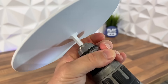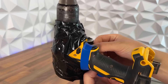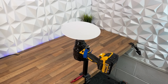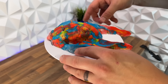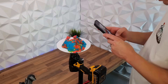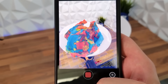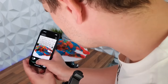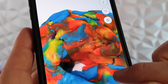So after a few minutes and less than a dollar of filament, I attached it to my drill and with the help of some gaffer tape, I should be able to rotate the mouse 360 degrees and get a full scan. After deciding that manually controlling the drill was a better idea, I started getting my scan. But even though I'd set up everything right, I couldn't get the LiDAR scanner to actually work — it seems LiDAR is more designed for quickly scanning larger areas and spaces rather than stationary objects. So I switched over to photo mode where I had to take a sequence of photos all around the object to get as much detail as possible. And the results were incredible.